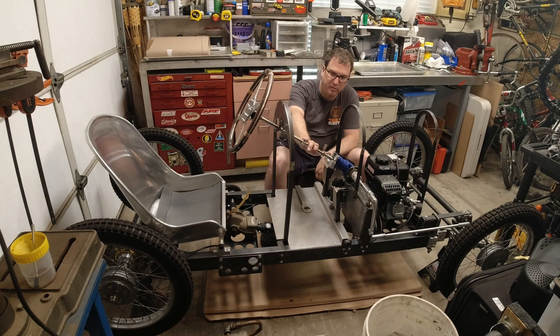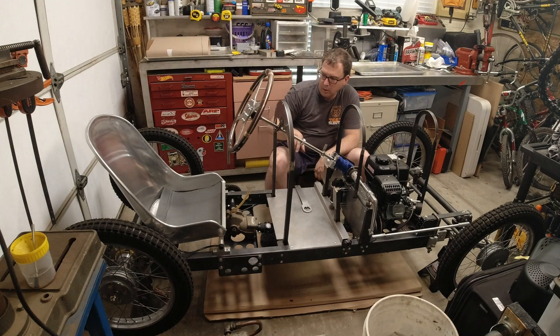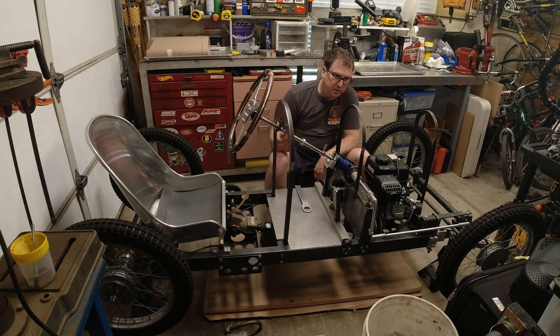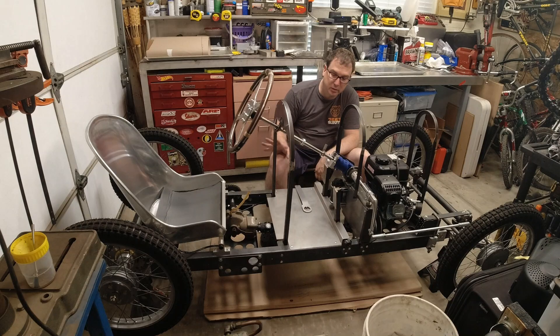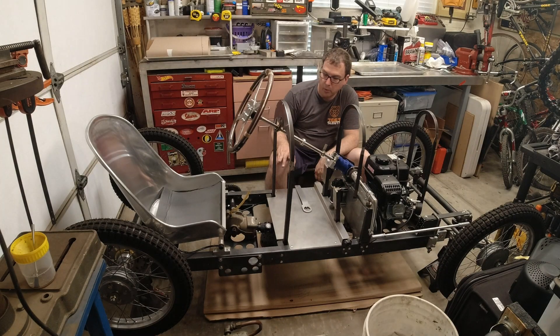Also, we're going to lay down the steering shaft five degrees. I've got some new brackets for that, so we'll drop that angle, and then I've got to have a new hoop plate made that the end of the steering attaches to, because that's going to be lower. All the cart's working pretty well — I've been waiting on some parts, finally got them, so hopefully next week we'll be installing the new drive shaft system. Let's get to work.